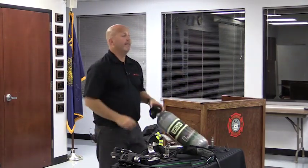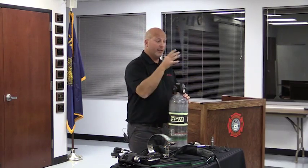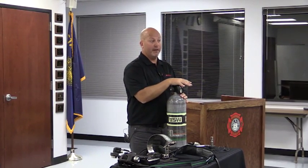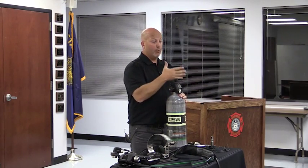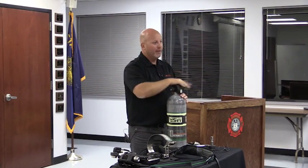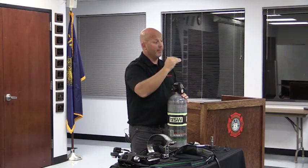What's the rated time? Oh, I'm sorry. This is considered a 45-minute cylinder. 66 cubic feet of air is what it has. Your current bottles are 30-minute cylinders, and they have 45 cubic feet of air. It's a rating, because nobody's going to get 45 minutes out of it, but we rate these as 45-minute cylinders. Make sense? That's from top to bottom, not down to the low alarm.